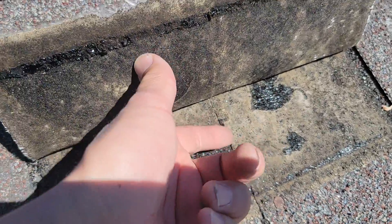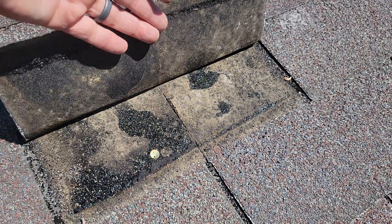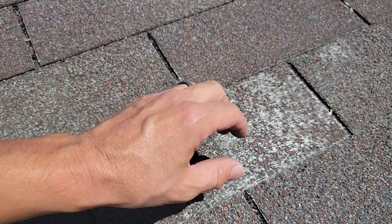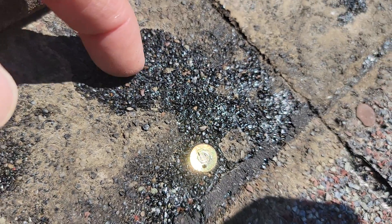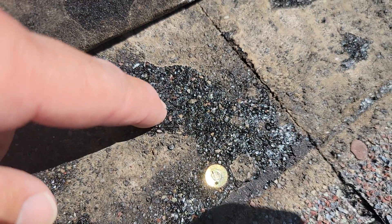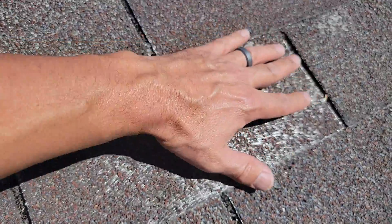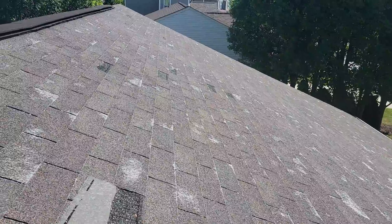When you've got a keyway that opens up right here, that right there is an easy invitation for water to come in. We can look at this and verify the sun is wreaking havoc on the asphalt here. But notice the headlap - the overlapping portion - has prevented the sun from mostly getting to that side. It's basically acting as a shade, so the sun hasn't gotten to the covered portion, but it has absolutely destroyed the tab, the whole front section. The sun's wreaking havoc on the entire roof.